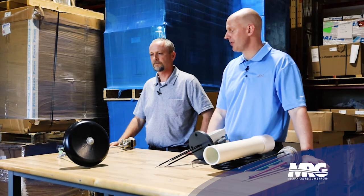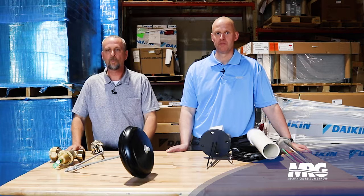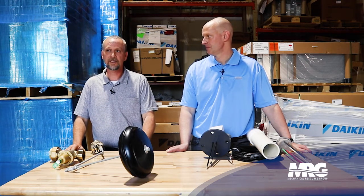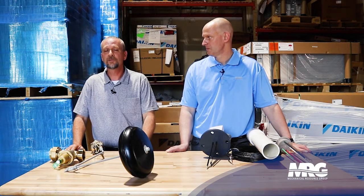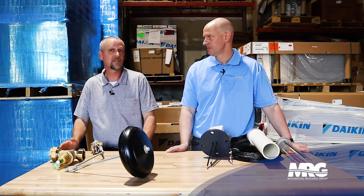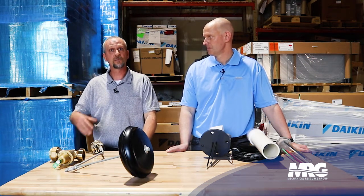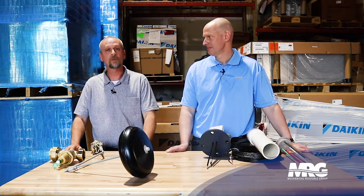Tell me what we've got going on here and why makeup water control is so important. We do put water in cooling towers and we use that water to cool off mechanical equipment in the building, and that water evaporates. A little known fact that people don't realize: normal operation on a hundred-ton cooling tower, you can lose up to 600,000 gallons of water a year through normal evaporation. That's normal. So the last thing you want to do is compound that problem by losing more water because you've got inadequate water level control.